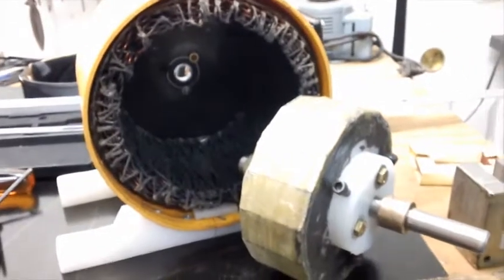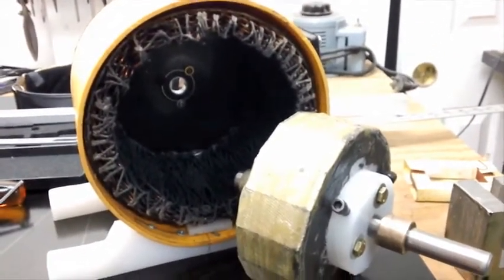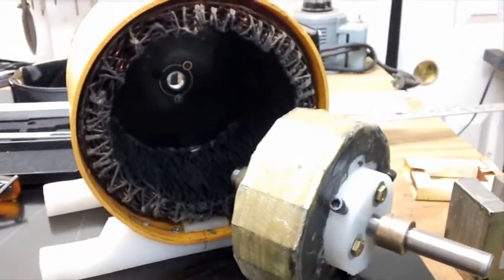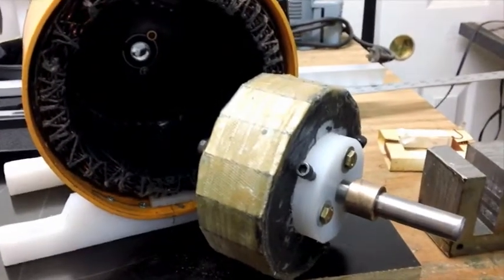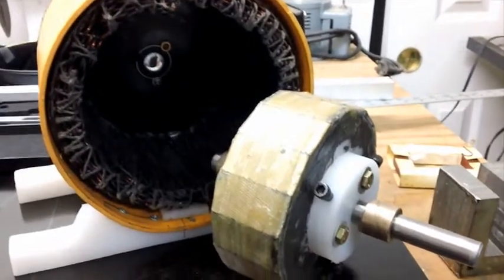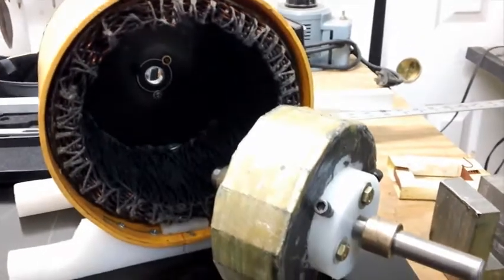This is what I had, so that's why I ended up doing that. It would spin perfectly — there weren't any issues with it working. I was just afraid it was going to blow up on me. I worried about its design more than anything, and that's really why I abandoned the concept. The generator itself made four or five volts at higher amps. The size of wire I'm using is number 14, so the wire was big, so I couldn't get as many turns in the magnetic field.